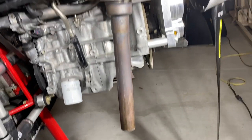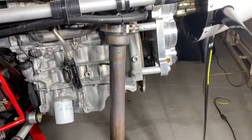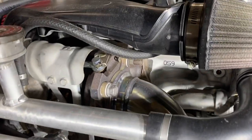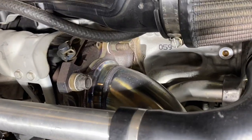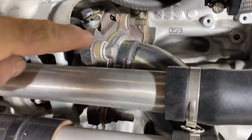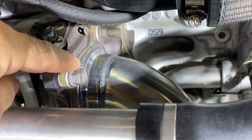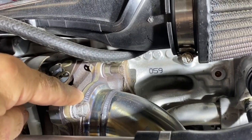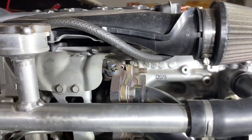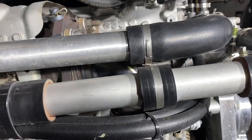The exhaust is lightweight, extremely quiet, and not likely to crack because of its construction. What you have is an elbow that bolts to the turbocharger — use any exhaust bolts but it's always important to put anti-seize on them because over time it gets harder and harder to remove. You don't even have to tighten them that hard; just check them once in a while, because you want to be able to maintain or replace a gasket in the future.